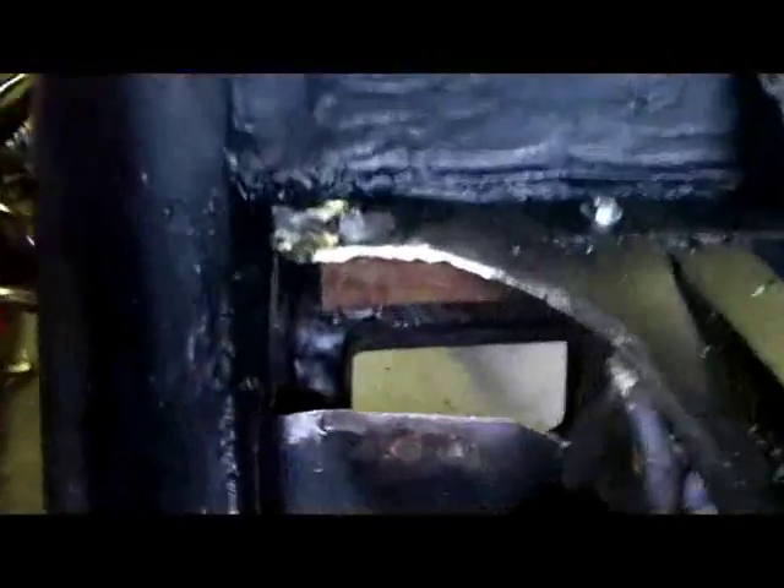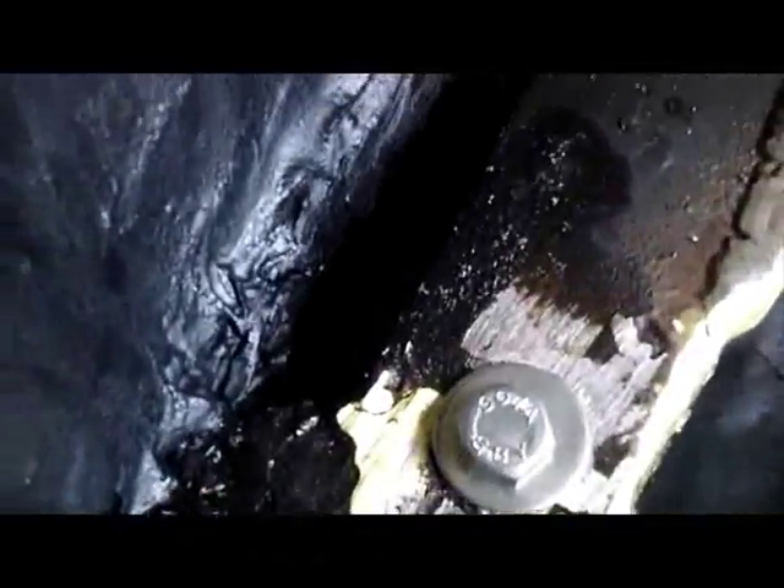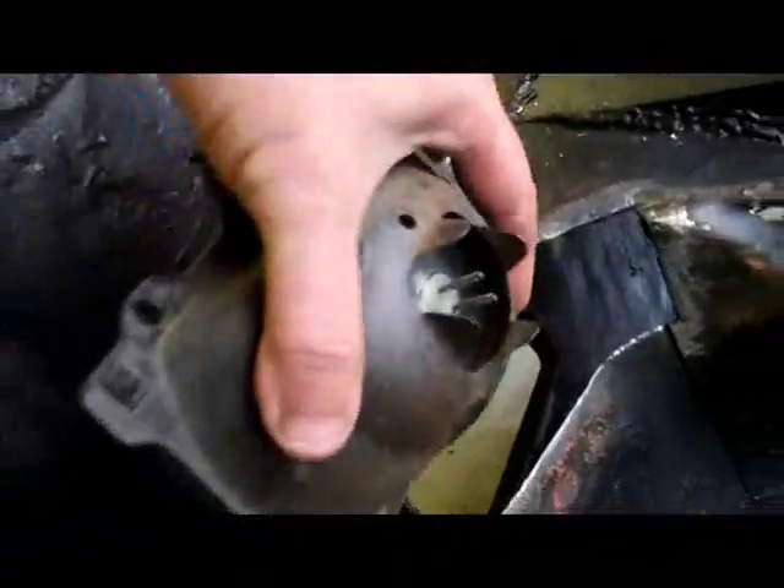I'm in the garage working on making those fit in there. I found some inch and three-quarter angle iron, cut it to seven and a half inches long. I clamped them up underneath and drilled some three-eighths holes and I got some bolts going. My plan is this will be the face of whatever bracket goes down here to hold this.